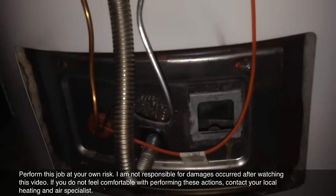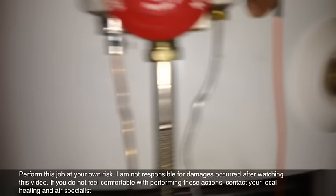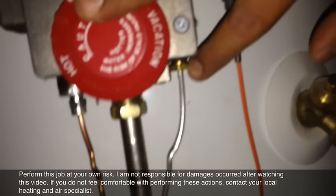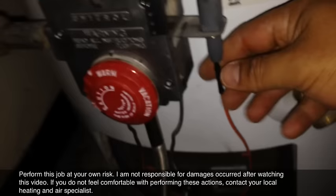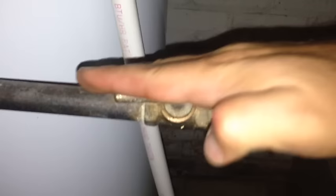What I did was: there are four screws that hold this terminal together — remove the screws and remove this component by unscrewing it. This is your main gas line for the main burner, and this is the gas line for the pilot itself. This here is your striker. Before taking anything apart, make sure you turn off your gas valve.